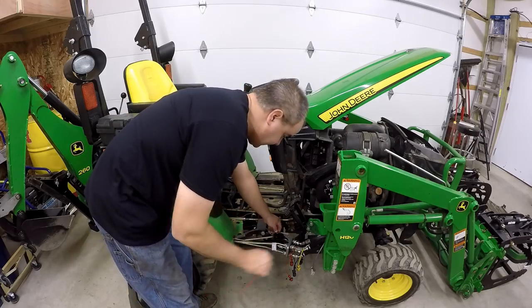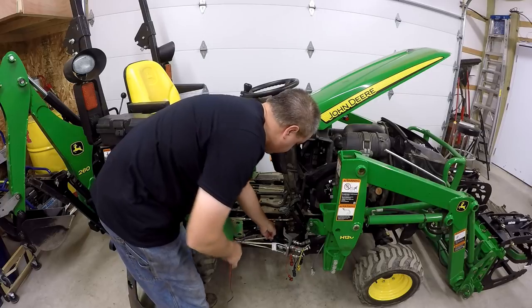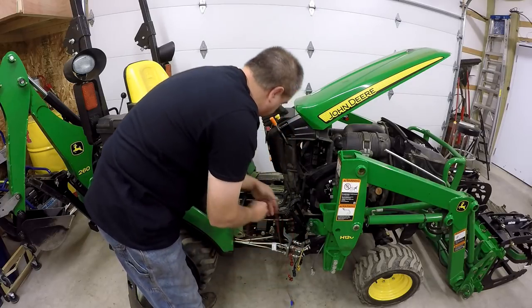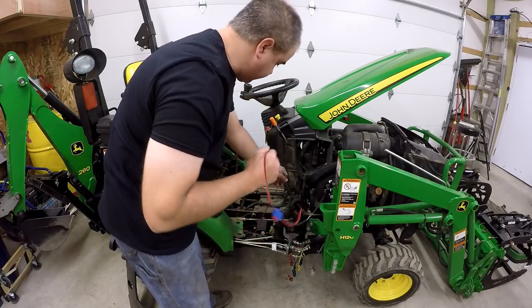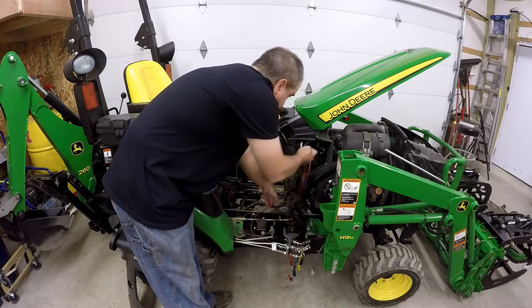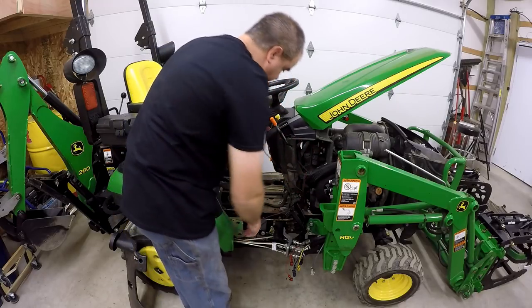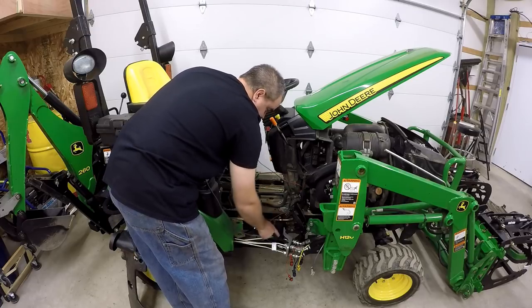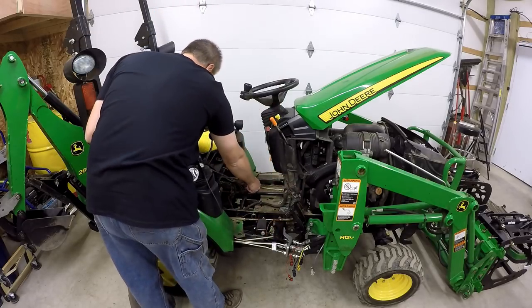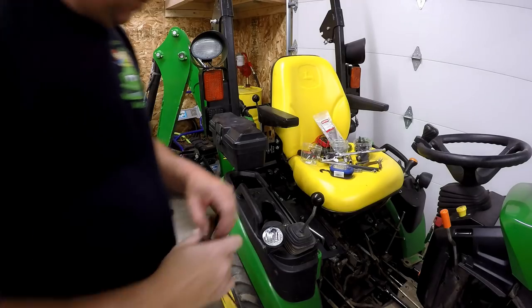Now, connected to that is the power wire. Okay, so assume we run that in here somewhere, like that. That power wire eventually is going to come across here up to the fuse box. Okay? What we're going to do is run this permanently under here some way. We believe we have enough wire left that we can run back on top of the floorboard all the way back here to the power adapter.